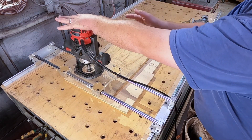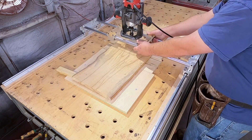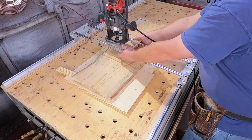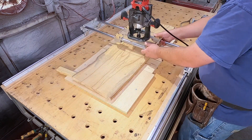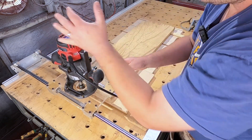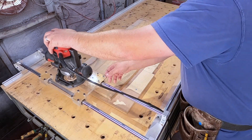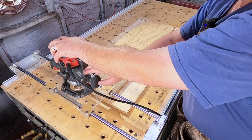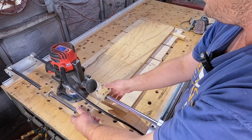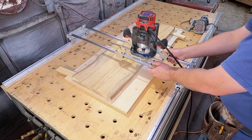These big bits are not made to be spun at 25,000 RPM — this router goes down to about 10,000 RPM, and based on what I could find, about 16,000 RPM is about the max for this bit size, so I'm going to run it at about 14,500. I am going to be wearing a respirator with this and I have my exhaust fans going, so the audio won't be great, but I'll briefly walk you through what I'm doing. We have the board secure and not moving. We've set the depth on one of our low points, and turning it over you can see that's going to take off quite a lot — so I'm going to use my turret stop to prevent the bit from going too far down.